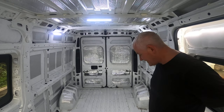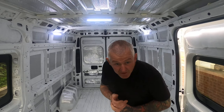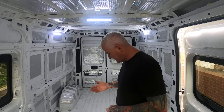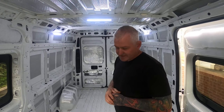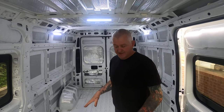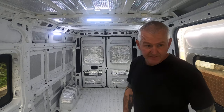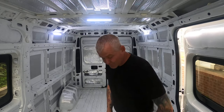And then literally in the house I've got my 25 mil treated battens, so I'll put them across at certain points, obviously fix them down with some glue and all that sort of stuff, and screw with some self-tapping screws at the outer points to make sure it's secure, rib across, and then I'll be able to fit all my 25 mil Celotex insulation in between and backfill it, and then hopefully I can just put the existing plywood back on.